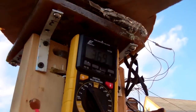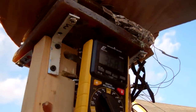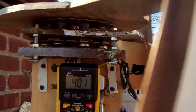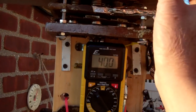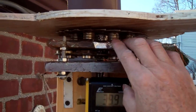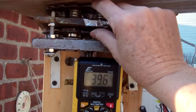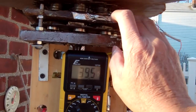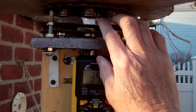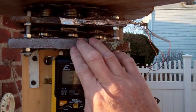The two or three volts will be added to this first stator so it's not wasted, because it is now in series. Here I have mounted the second stator to the vertical windmill that I have from before. The vertical windmill I have from before is a dual magnet plate, single stator with six coils and has a very fine gauge — about 26 or 27 gauge wire.